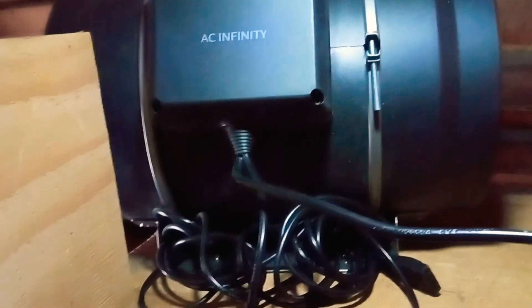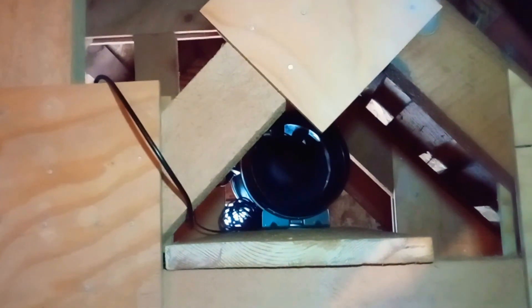It has zero vibration. I'm going to turn it on now so you can hear it from a distance. It's rated at 39 decibels, but that's what it's like right up close with no housing around it — just the fan with nothing hooked up. From about six feet away, here it is coming up to speed. No housing around it, nothing restraining it, and that is on full RPMs — max speed, no speed controller — at 800 cubic feet per minute.